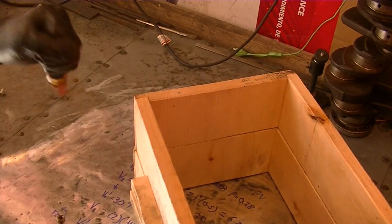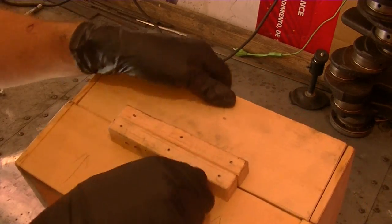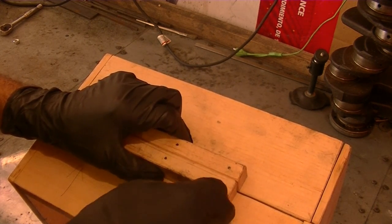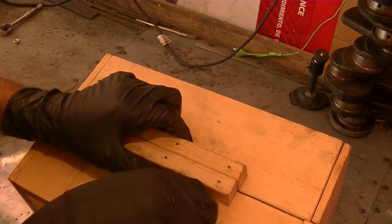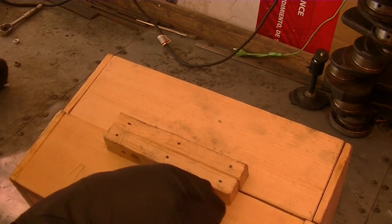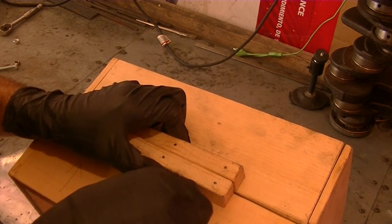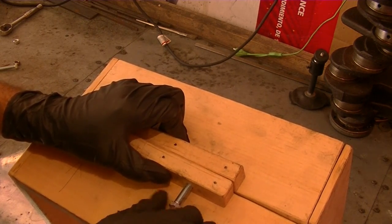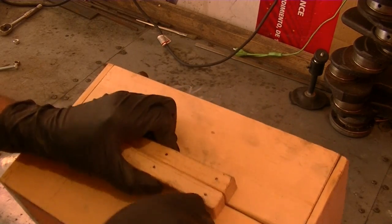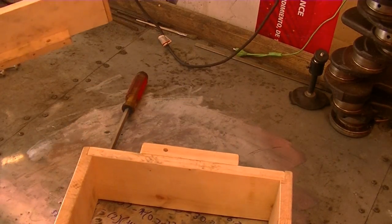So the one difference with cast iron is that one thing I'm going to do is actually clamp these two halves together. The reason I'm going to do that is because cast iron is very dense, and if you have a lot of it, which this pattern is going to have, a decent amount, then the top half can actually float on the cast iron and cause the cast iron to spill everywhere. Okay, these are a little bit too tight, I think. And I don't want that, so we're gonna clamp it shut.